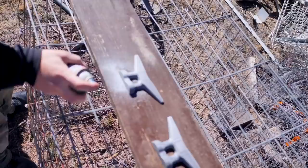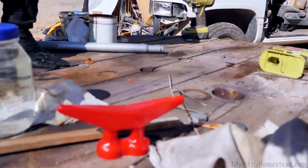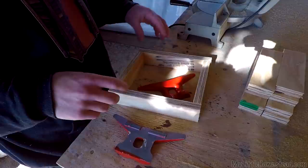Technically, the paint will survive more than the plastic. Okay. I painted this with engine block paint. The reason for the paint on the 3D print is the 3D print is rough, and it tends to stick to the mold, tears it up every time I pull the molds apart. So I need the part to be smooth so that it doesn't stick to the sand on the mold.